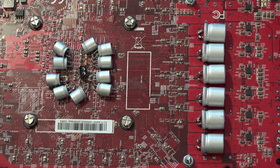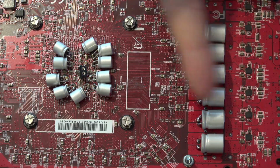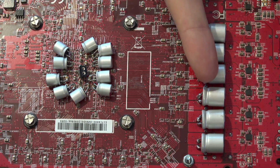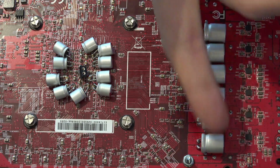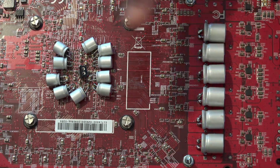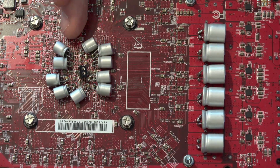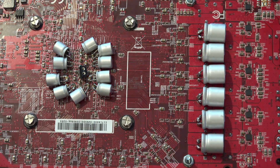If it leads to the peak voltage being lower, then add caps behind the core, don't add caps near the VRM. If it leads to no improvement, then don't add caps to the VRM anyway, because you're just wasting time, right? If the existence of these doesn't make a difference, don't bother with them. If the existence of these leads to an improvement, then yes, do bother with them. So there are 3 potential outcomes for that test.